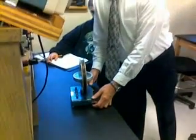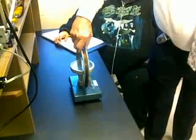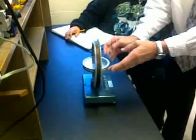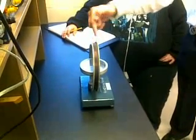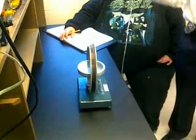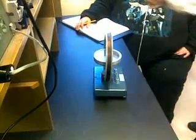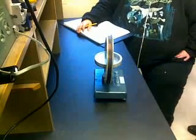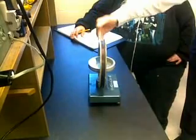I'm going to arrange this as carefully as I can so that the blue pointer of the compass is pointing due north. Obviously, there's no current going into this right now, so we carefully align this so that when there's no current in these coils — this is called magnet wire in here. It looks like ordinary copper, but the wires are insulated from each other. So if you need to make a connection, you take a razor blade and scrape the insulation off. Right now, no current here, so this is causing no magnetic field, and the compass is pointing due north. I move this so that it reads zero degrees — meaning the total magnetic field makes a zero degree angle with respect to this plane.